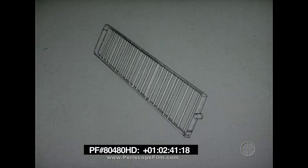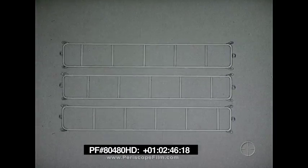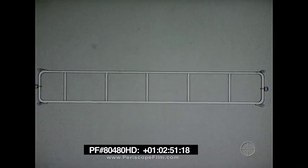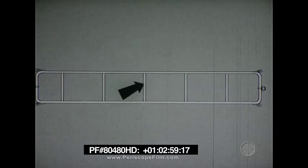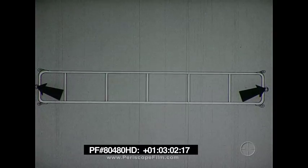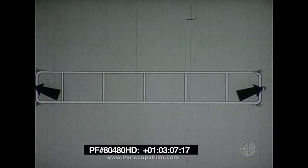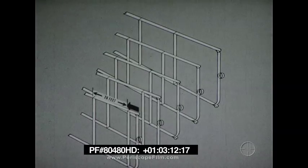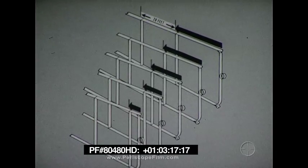The barricade consists of three webbing assemblies. Each webbing assembly contains five webbing systems. Each system consists of an upper loading strap, a lower loading strap connected to the upper loading strap by links, either five or six engaging straps on sliding D-rings, a connecting strap at each side attached with sliding D-rings, and the sewed-on support loop at each corner. The engaging straps are staggered for equal load distribution. Thus, if one of the loading straps should fail, the effect would be minimized.